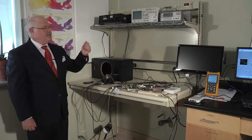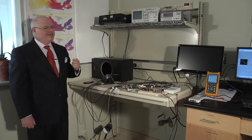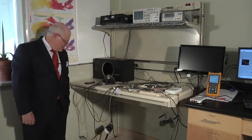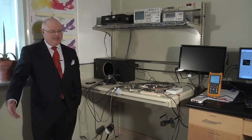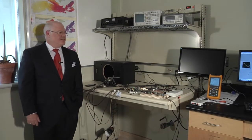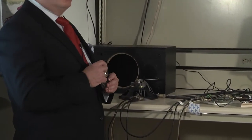We have our system running in acquisition mode, so there is no excitation provided by the speaker. The speaker is off. And what we're going to detect now is basically me lightly tapping my foot on this concrete floor, a diagonal distance of probably 1.5 meters from the sensor or so. But again, you can imagine this vibration going through all the steps that I just mentioned. So let's just give it a whirl. Oh, and just got a message telling me that fault was detected.